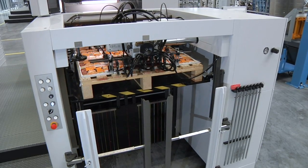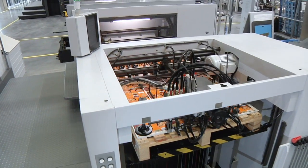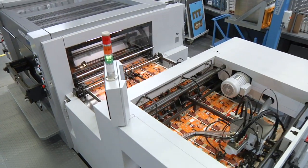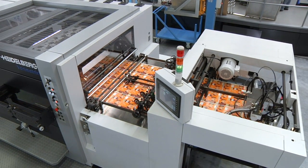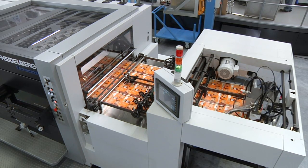The VeriMatrix is able to handle paper from 80 grams per square meter, boards of up to 1,400 grams per square meter, and corrugated boards of up to 4 millimeters thickness. The optional corrugated board kit can be added to facilitate frequent processing of corrugated boards.